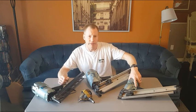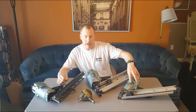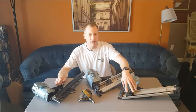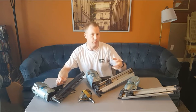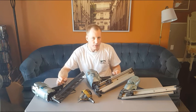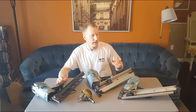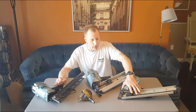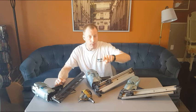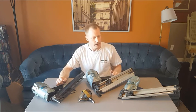This particular gun is called a TECO gun, and it has the capacity to shoot only inch-and-a-half and two-and-a-half inch nails. Those nails are specifically for connecting metal straps, hurricane ties, or seismic ties — which is kind of a regional thing depending on whether you're in earthquake or hurricane country. The nail actually sticks out of the nose of the gun so you can place the point in the hole of the strap connector and fire one nail.